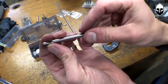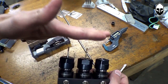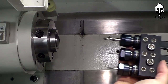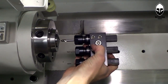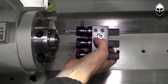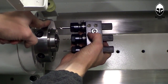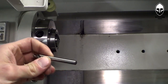I'm going to try to shorten this spotting tool on the lathe because my drill bit and my tap ended up being the exact same height. For gang tools you kind of want them all to be the same height. This is a gang tool lathe — so instead of having a big turret tool changer, this just lets you slide the table to a different position. If the workpiece is right in the center, I would spot it, then move up and drill it, then move up and tap it. If they're not all the same length, the spotting tool can interfere and run into the spindle and cause problems. Whereas if they're all on the same plane, it would work very well.